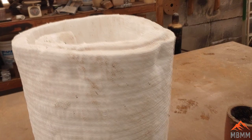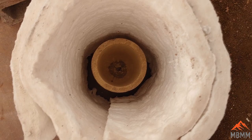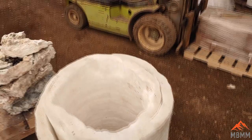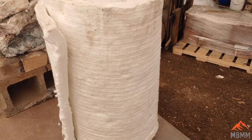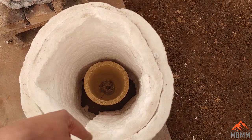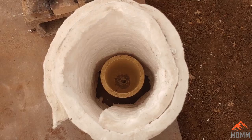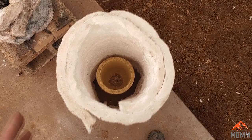For those of us who aren't very math savvy, I just took my wrap and formed it tight enough to fit the crucible with a little bit of room on the edges — it's a little less than half of what I need. This is one inch kaowool; you can buy it two inches thick which I usually prefer for more insulation, but all I have right now is one inch so I'm just going to double wrap it and use some water glass to glue the portions together so I get two inch thick insulation. Now I've got my size, so I'm going to cut the roll in half and see where we go from there.